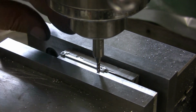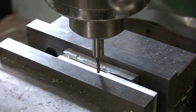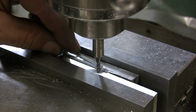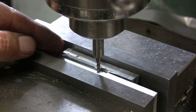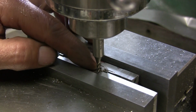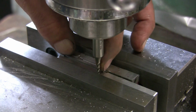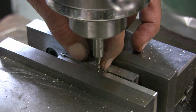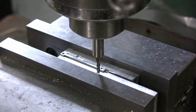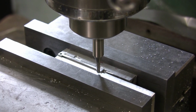So now we take it out of there and knock the little burrs off a little bit. And now we'll put it in upside down with the side we just cut down and get it back in there. After a little bit of the shakes again today. Again, hold it down, hold the 2 ends down especially. And snug it up. Now I'm going to crank up the 15 thou for the second side. And we'll do the same thing as we just did.